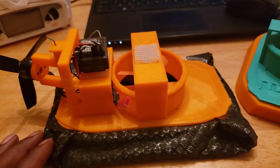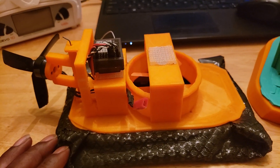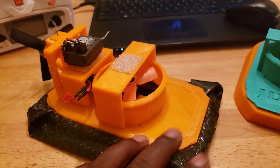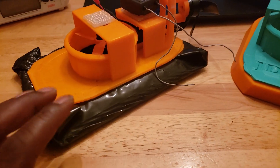The battery I use for this is a 3S 1000 milliamp battery with a high discharge rating — about 65C. With that one battery this guy will run about 20 minutes or so on a flat smooth surface. You guys have seen the video — it's ripping around pretty fast, it's pretty awesome.